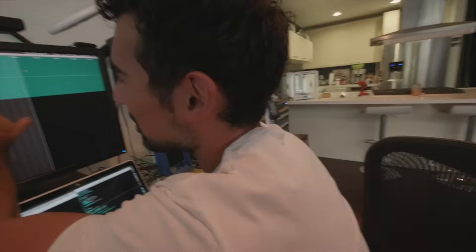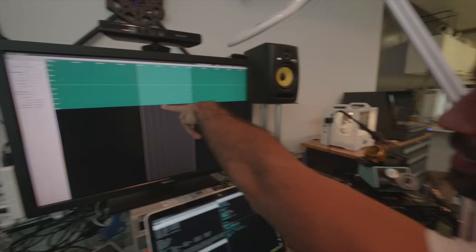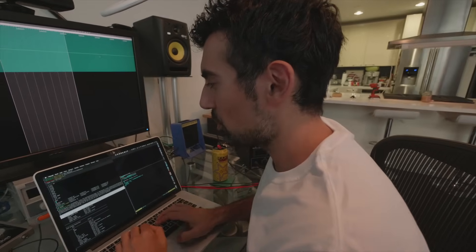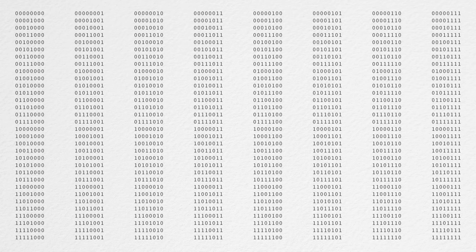Now, Sammy might be overstating how easy it would be to open the garage, because presumably you can't send all the codes back to back — otherwise how does the garage receiver know what constitutes one code? So you probably have to leave a gap between codes. Let's say we left a gap roughly equal in length to the code itself. Well, that doubles the time out to 16 seconds. Okay, still not great, but that reveals the shortcomings of 8-bit codes. But a lot of garages these days are actually 12-bit.